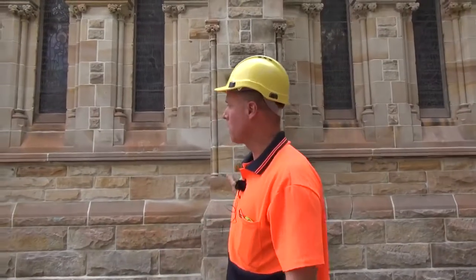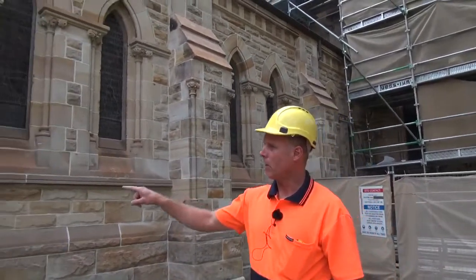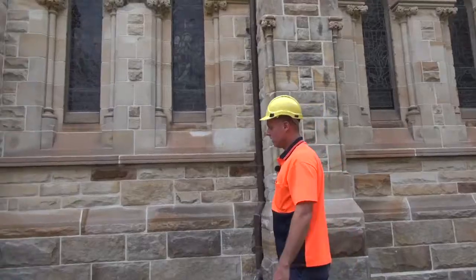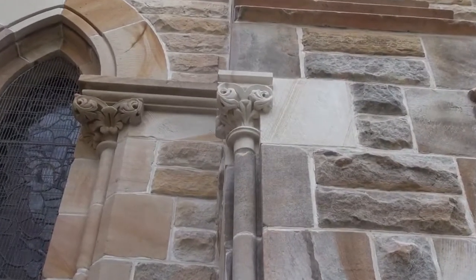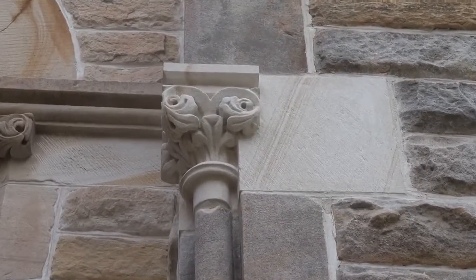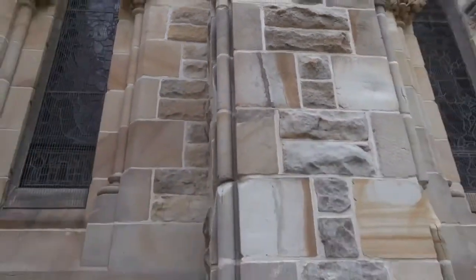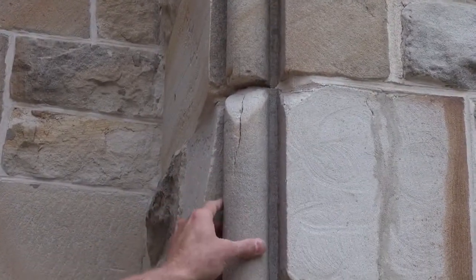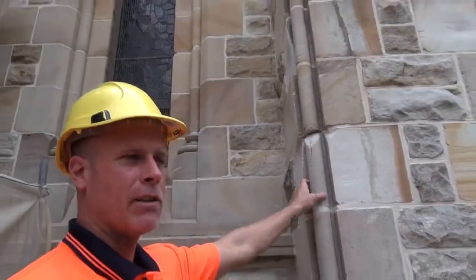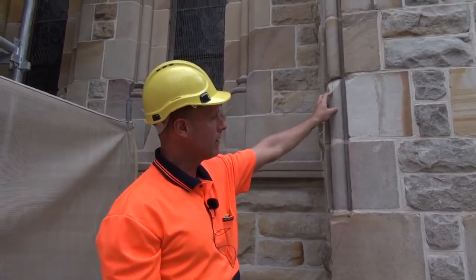This is an area that we've already completed. The pointing has been fully removed and repointed. There have been a couple of indents — just up here, we've had a stone replacement. That was one of the elements that had failed, and our banker masons have recreated what was there to the best of their ability with the detail we could get from the existing stones. In stone masonry, it's always better to restore things that are higher up than fabric that's down low — we can always get to those at a later date.